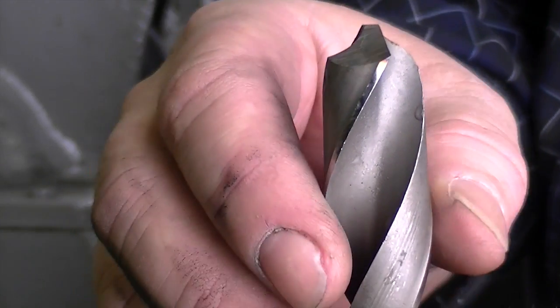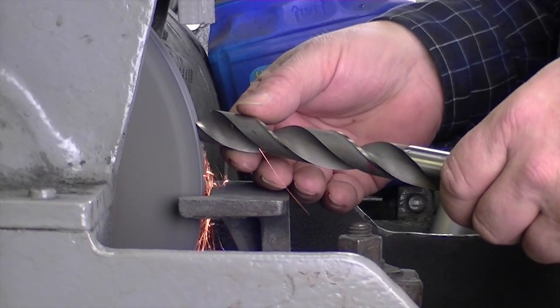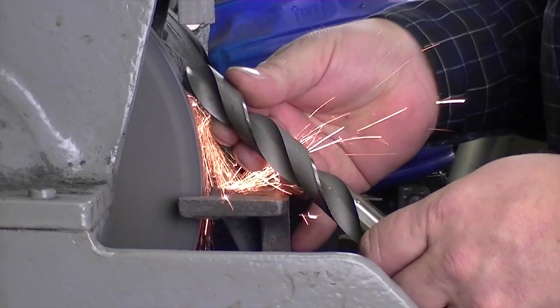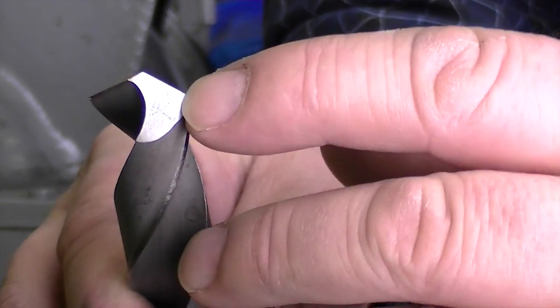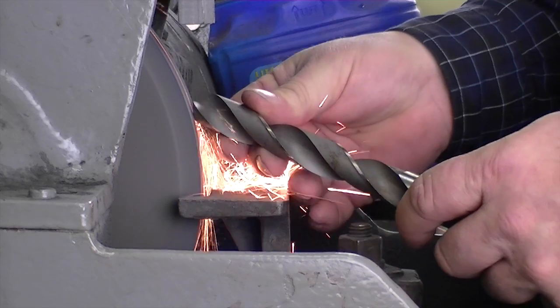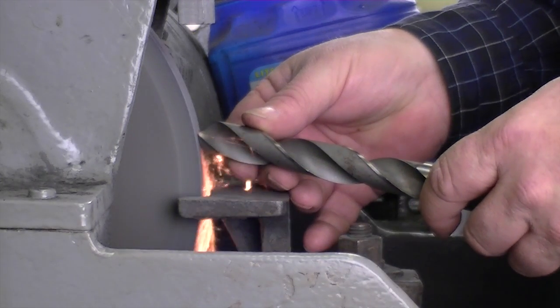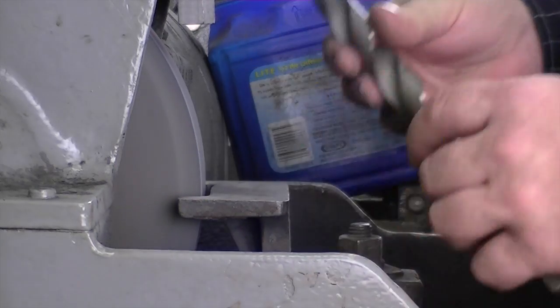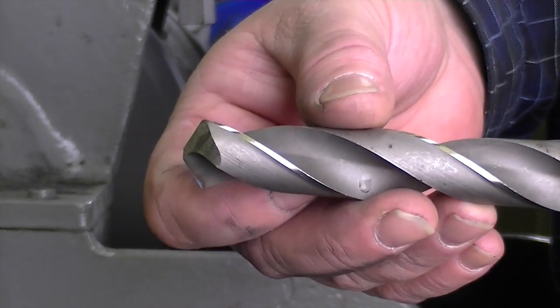Now let's find out how to get rid of that heel — this is actually the most pleasant part for me. Address the wheel exactly the same way as in the previous step, and then just raise the tip while lowering the shank. What happens is the heel just gets ground away in a nice smooth fashion. Notice how that's all one grind now? That's the goal. Let's do it on the other flute — just raise the tip and lower the shank. I find if I start with the primary with sparks coming over the edge of the cutting lip and then move forward, I get a nice solid grind from top to bottom.